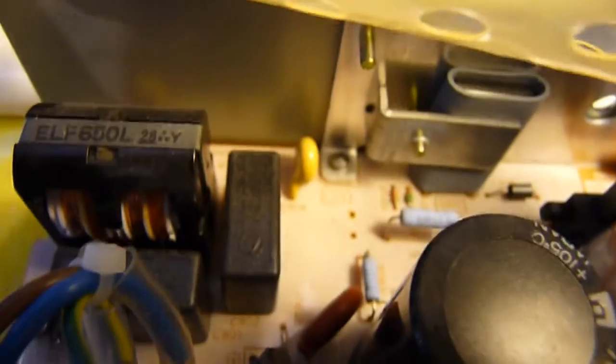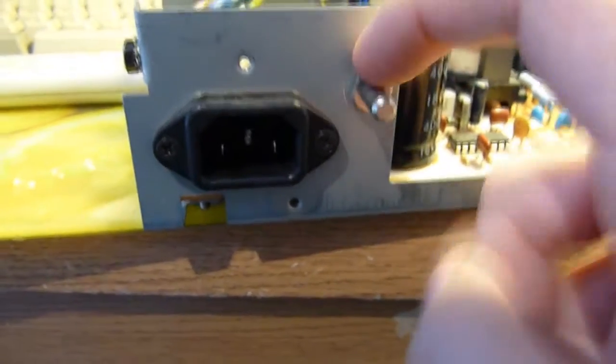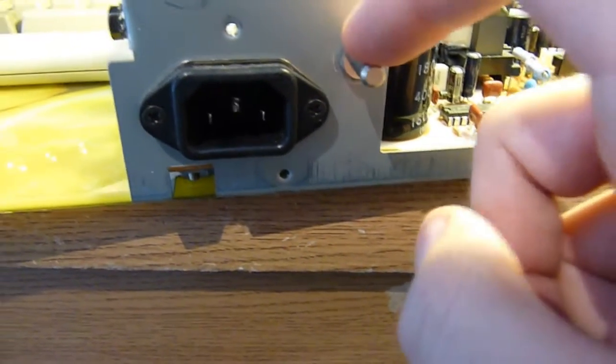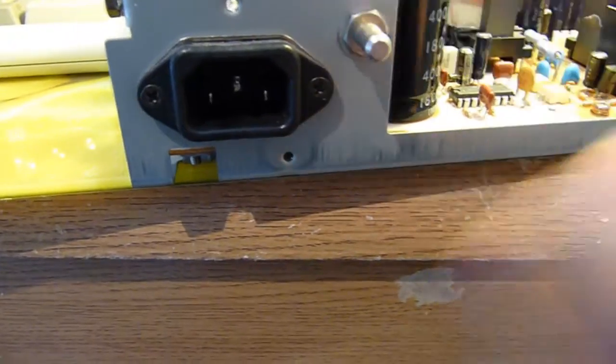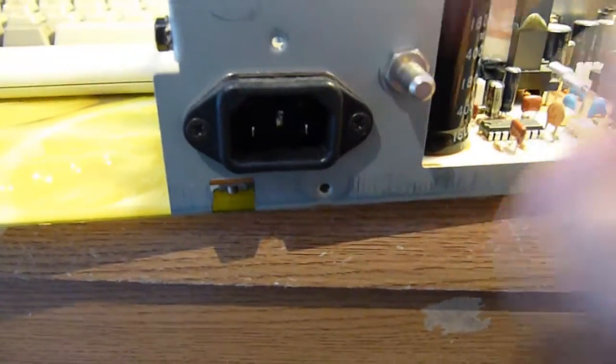Then of course you go to your usual standard filtration you see in all but the very worst of power supplies. And then of course we've got this little lug here. Now some of you will be thinking, what the hell's this for? This is basically an extra external grounding point, for the countries that have a very dubious sense of what earth mains is. That's why that exists. And trust me, there are plenty of countries which have absolutely woeful power systems that are just downright dangerous.